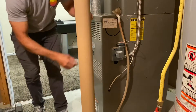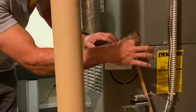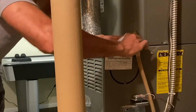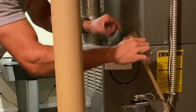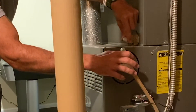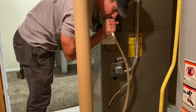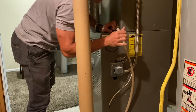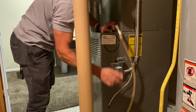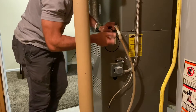With this one it's going to be pretty simple because we have just a plastic drain tube leading down over to a floor drain. You'll want to pull it off. A lot of times if this actual tube is clogged somewhere in the line, once you pull it off you might have a lot of water trying to dump out, so maybe put your finger over that. Then you're going to want to blow on the hose, just make sure it's cleared out so the water can get out of your evaporator coil pan and out to the drain instead of filling up the pan and leaking all over your furnace and floor.